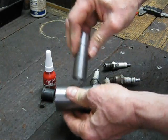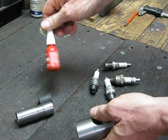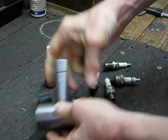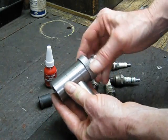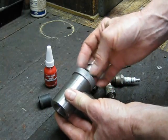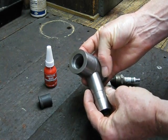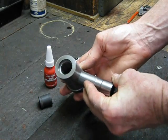That's the whole unit. This sleeve here, which is more scrap, I'll lock in with some Loctite 609 super retainer. I was going to weld it but there's really no point — there's not much load on it and it would only mess up a nice bit of machining. I even went mad and ran the new knurl I got around it to make it look like the real McCoy. This afternoon I'll Loctite in this tube, leave it 24 hours, and we'll try it out tomorrow. Will the Mark II version actually work? You better come back and find out — stay tuned.